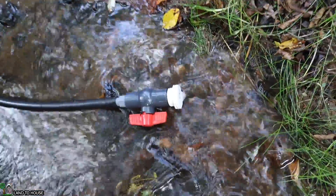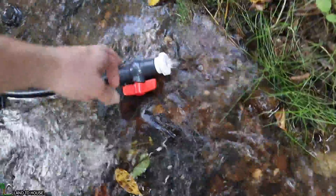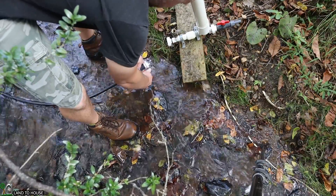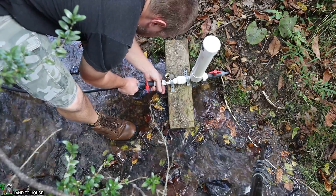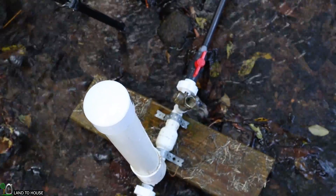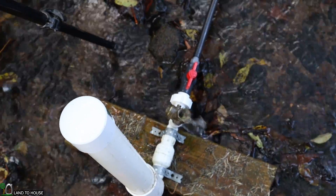The pickup-and-drop method would not work, so I went up to the midpoint between the 100 and 200-foot mark and was able to disconnect that and get the first half air-free. Now the second half is becoming air-free. Now that I have full flow on the drive pipe, I'm going to close this off and attach the union. Open this up and water will flow out the waste valve. I still have some air in the line, but I've tilted the waste valve a little bit to the side so that it will close a little bit easier, and that will allow this pump to continue to operate even with that air in the line.